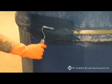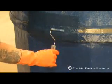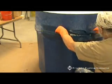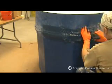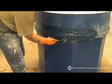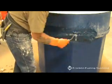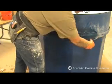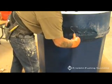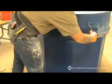White areas in the mat indicate the presence of air bubbles. Roll over the mat horizontally and vertically with the roller as many times as needed to eliminate all bubbles. Continue this all the way around the sump, overlapping each mat with the one previously applied. Three alternating layers of mat are needed to be applied to each sump joint to ensure a water-tight seal. Resin will soak through the first layer, so don't apply as much resin to the second and third layers as you did the first. Also, clean the roller with acetone periodically so that it keeps rolling freely. Finalize the mat installation by spreading some extra resin across the mat, and again remove any and all air pockets. Please refer to the cure time charts for the appropriate cure times.